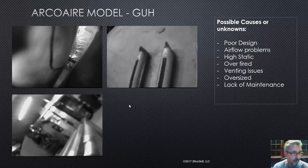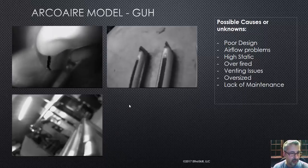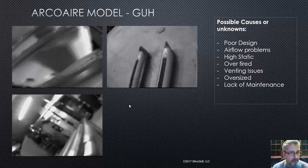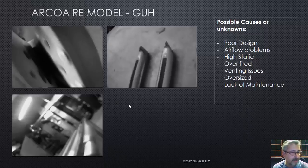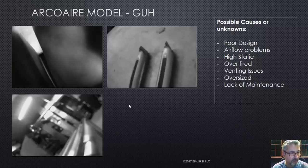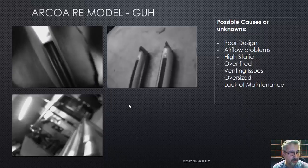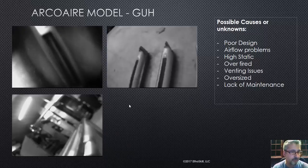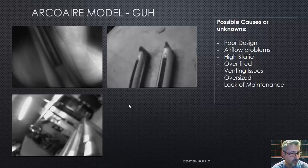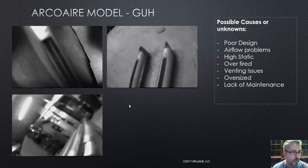There's one of the fractures. That's a major fracture — that thing was busted wide open. And then when I went, that was one cell. If you go down from the top, it's not as easy to see, so you've got to really be careful. With evaporator coils sitting on top of these furnaces and all kinds of sheet metal or duct board obstructions, that's where I found it. When I found this one, as severe as it was, I proceeded to cut the back of the furnace open — and that's how you got that first view.